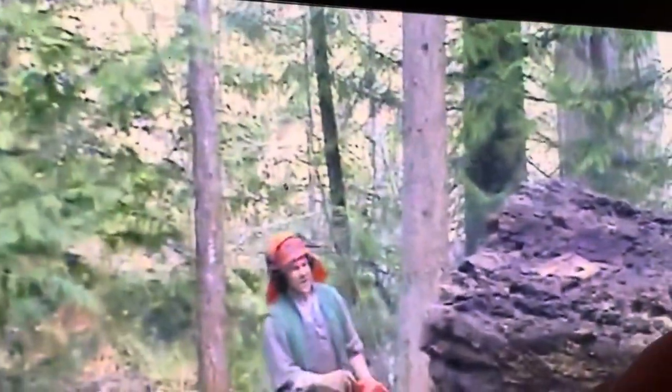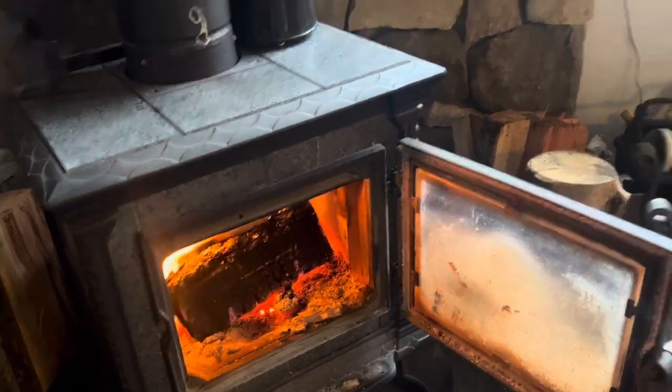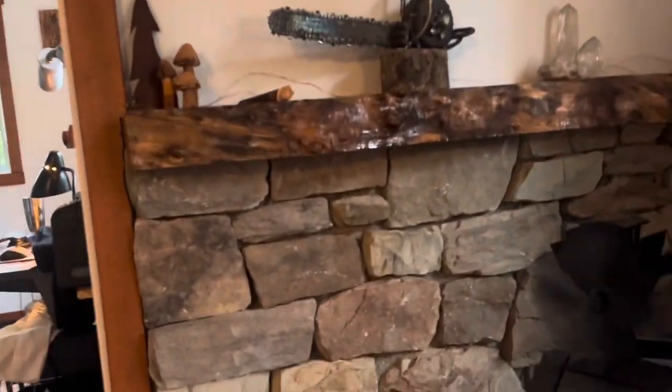You see the height of that stump? Friends, I'm going to talk about wet, cold weather and what happens with a down draft. It pushes air. If the air is cooler above your chimney it draws flame and draws draft, but if it's warmer outside — you know what I'm saying — it's a low pressure that pushes it down.